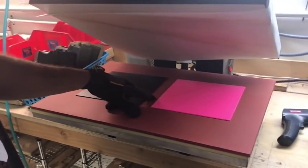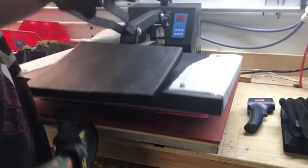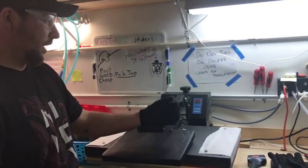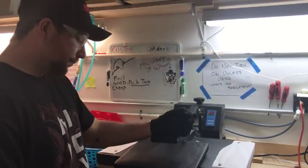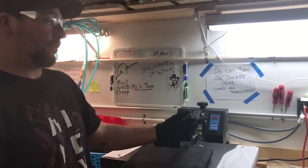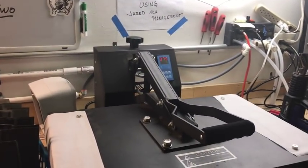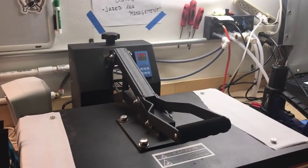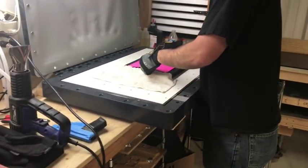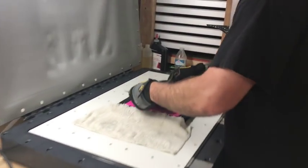We're heating up the two pieces of plastic — we've got a pink back and a carbon fiber front. We're going to heat her up and throw it in the vacuum press to mold a holster. We let it cook for 60 seconds at 365 to 375 degrees. We also heat up the foam pad to get it higher than ambient temperature so it doesn't rob heat from the plastic. Hot plastic means good definition. Pink goes down first, grain running the right way, P365 inside the plastic, black carbon fiber plastic on top.